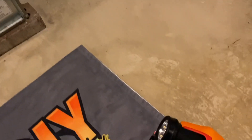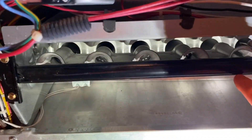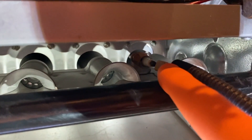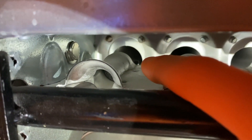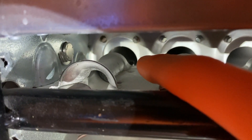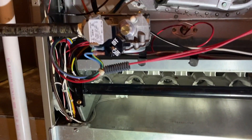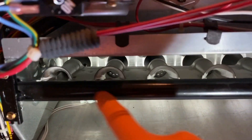I'm going to turn on my flashlight and let's talk about a couple of parts. This is the gas line that provides gas to each tube where your flames will be coming out. Here is your flame sensor, and on the opposite side you have your igniter. You'll notice a little tab sticking up — during ignition your igniter will heat up and gas will flow through the system.